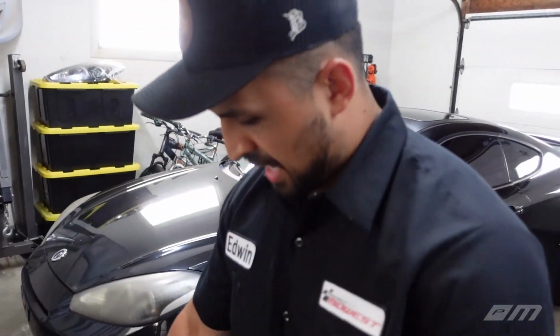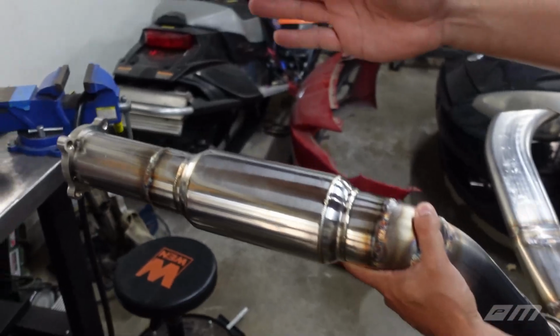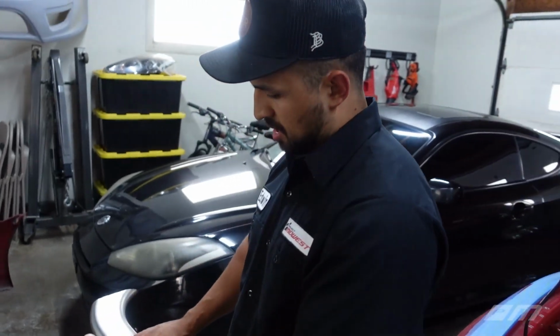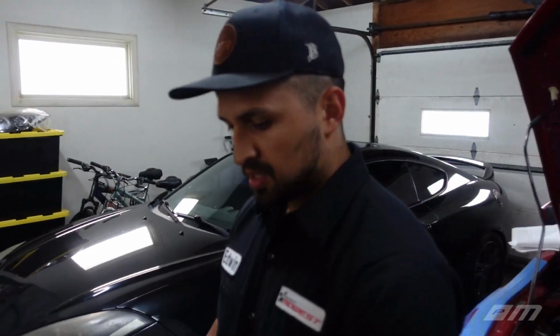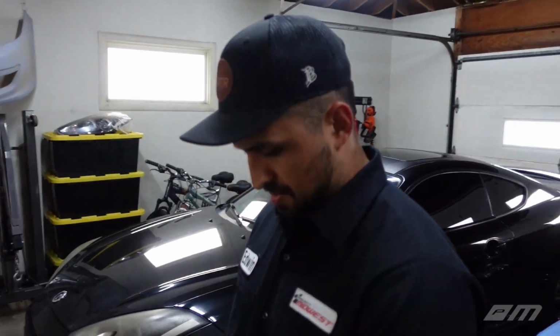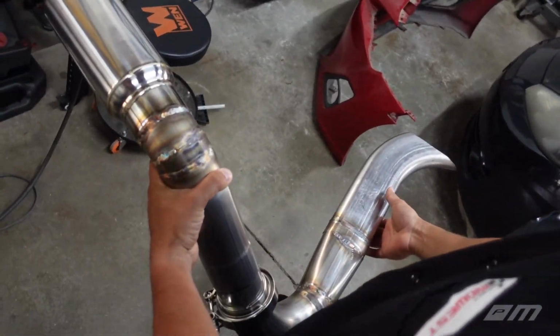So anyways, what we'll end up doing, since this is the passenger side, by the way, so turbo coming out the side, I think I'm gonna put some exhaust hangers with some rubber grommets that are then bolted onto the body just to allow a little bit of play, since we really don't have any flex pipes. I don't think it's gonna crack the exhaust. If it cracks, it's probably gonna be because of welds, not because of vibrations. So just to give it a good amount of movement, and it's also not very long, so I imagine that, you know, I think if we were going all the way back, we definitely need some flex pipes, for sure, or something in place. But I agree. I think we're all right here. So that'll be the game plan.